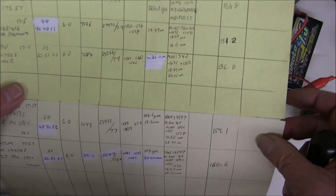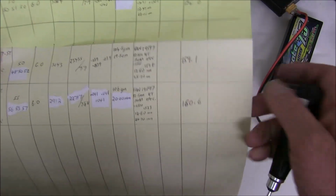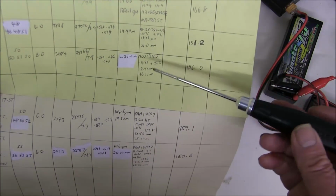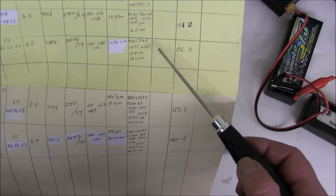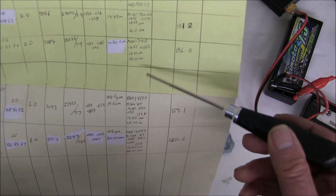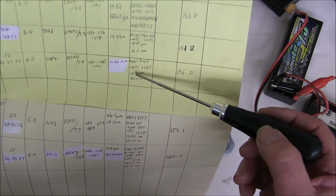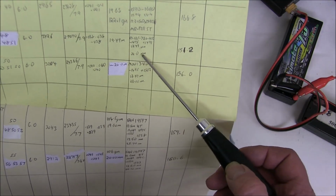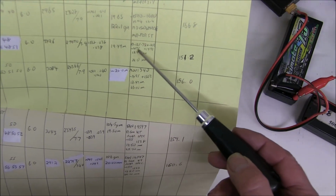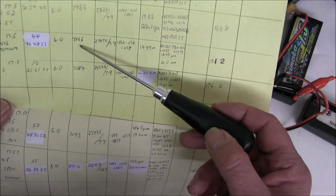Now the strength of the rotor you think would probably be pulling it down, and I did measure them over 1500 Gauss, very strong rotors. But if you check, the Motive has a 1500 Gauss rotor and the same length, I would say, 26mm measures. It's probably from the same manufacturer. Now the R1 still used the old 24mm long rotor. It was just under 1500 Gauss, but I don't know if that accounts for the fact that it revs so well.